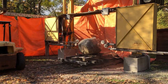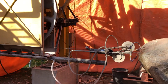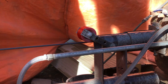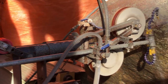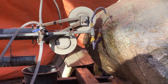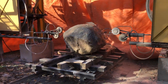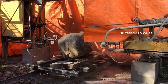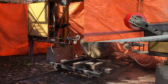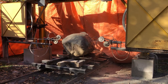I'll take you in and show the skateboard wheel I use just to keep the vibration down on the wire — see it right there. I did that because I upped the feed rate. Right now I'm going an inch and a half a minute, and I noticed as I increased the feed rate I got more vibration in the wire. That little wheel just keeps the bounce down so it doesn't hit that pipe as it goes to the other two guide wheels. I don't know how long the bearing will last in there, but we'll see.